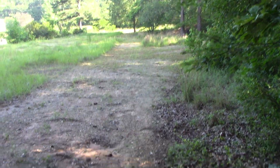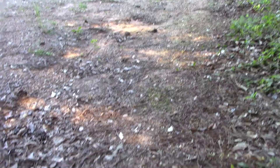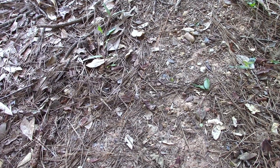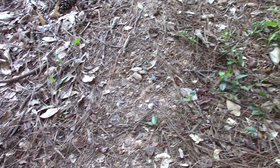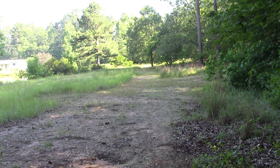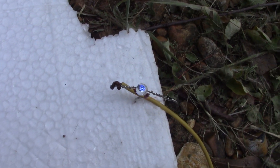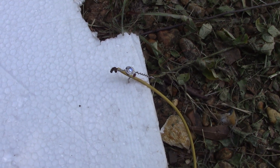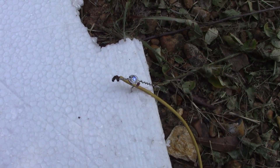The first thing to note while we're walking down: hopefully you can see this wire — this is the original 30 gauge with five connecting points on it, we had to piece it together. The other wire isn't wrapped around it or anything like that — it's about 10–12 inches away. And here we are at the far end, and as you can see that LED is partially lit. So the system does work to that distance, and I am very, very pleased with that result. If I hold the side it does actually brighten up.